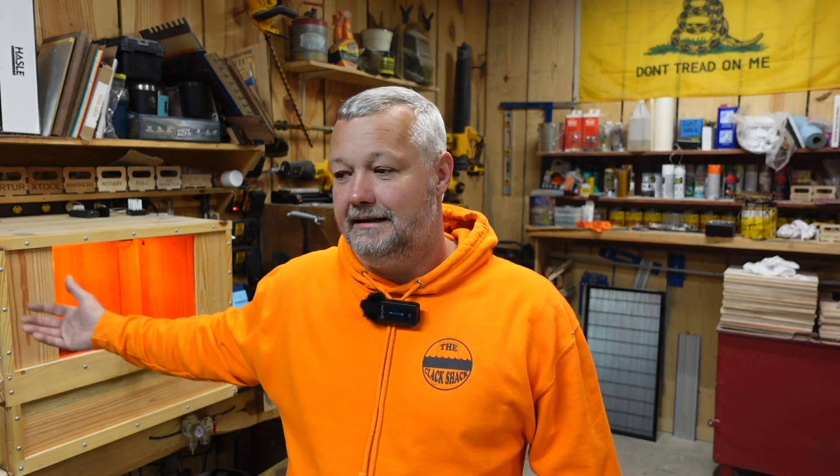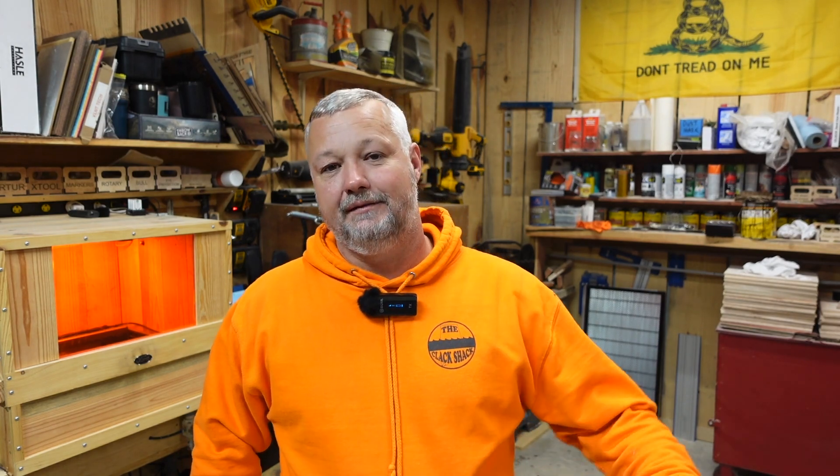The other part of that question is enclosures. The enclosures in my shop are not laser safe. If people come in I still require them to wear glasses, because even though it's orange plexiglass that cuts down the blue light, it is not certified as laser safe. I don't run the shields on my machines, so there's more potential for reflectivity to be brighter and damage your eyes. If you're not running shields or an enclosure, you definitely have to have glasses.